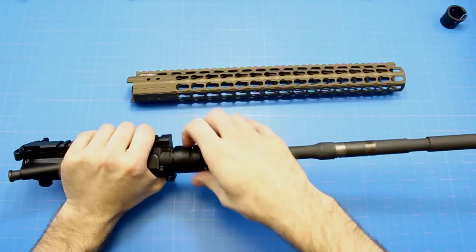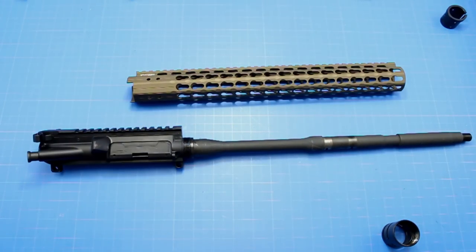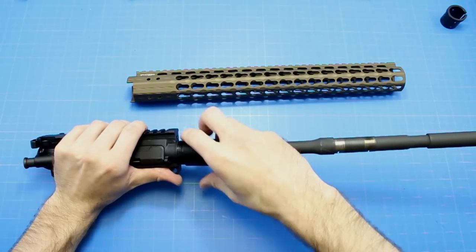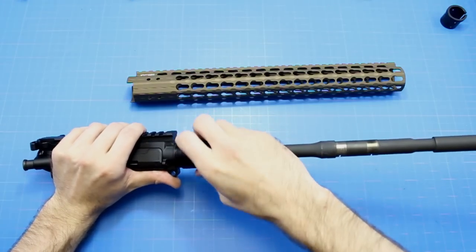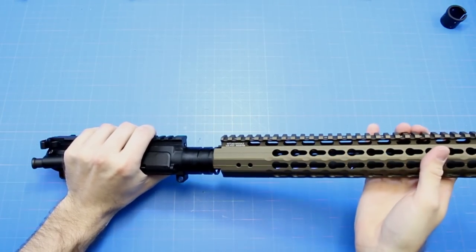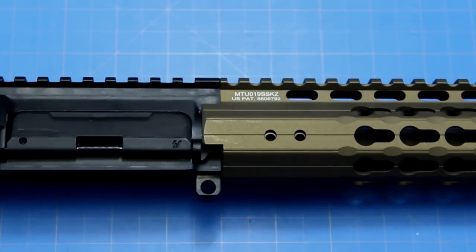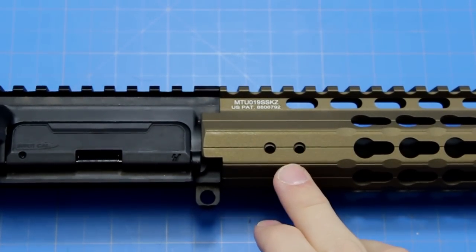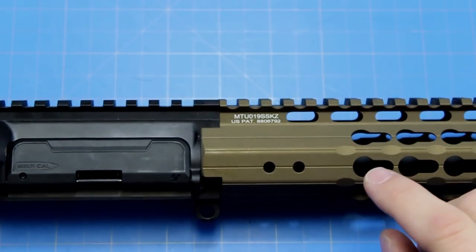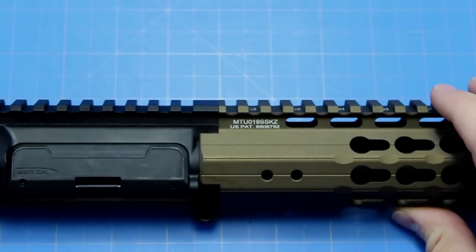So we're going to remove the rail and remove the barrel nut there. I'm going to make a guess and install two spacers here to see if that gets the job done. We're going to put them down the barrel, take the barrel nut and reinstall it hand tight again, and double check that we have nothing protruding into those screw holes. Take the rail and slide it on. So as you guys can see we are lined up, but the rounded edge - the tip of the slot - is protruding to the screw hole slightly. That's okay because when we tighten this thing it's going to go righty tighty, so these slots are going to rotate to the right and tighten down far enough where those slot walls will move further up the receiver and leave those holes wide open. So I'm going to consider that good to go.